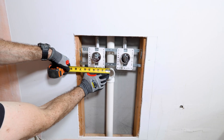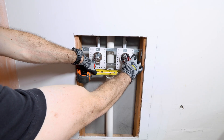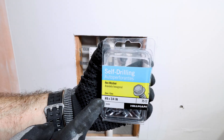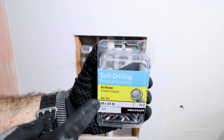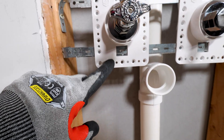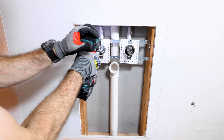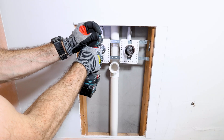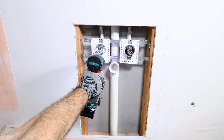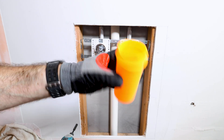The nice thing with the fixture outlet box is that even though it's on those brackets, you can still move it. In this case, I want them to be about three inches on center from that sanitary tee. Then I'll use self-drilling screws to secure the fixture outlet box to the bracket. There are two holes at the top and the bottom, and I simply use two of those self-drilling screws with an impact driver, and that secures it in place. These aren't going to move anywhere, but if I had to remove them, it wouldn't be an issue whatsoever — they're super strong.